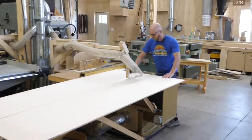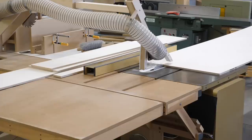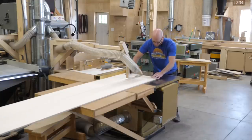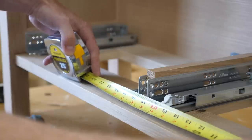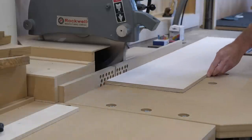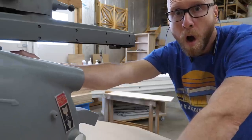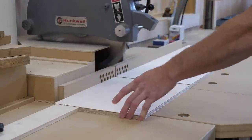With the slides in, I could measure and calculate the drawer box sizes. Any time I'm building drawer boxes, I always start by cutting strips at the table saw, and then I move on to cross-cutting to length. I use the super smooth cutting delta 16-inch radial arm saw to cross-cut to length — I have a restoration video of this tool on my channel. I'm always cautious with this tool: not only could it cut off a finger, but it could cut a hole in the space-time continuum if given a chance.